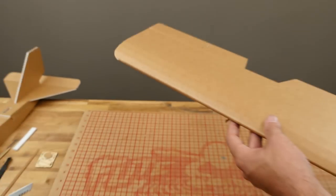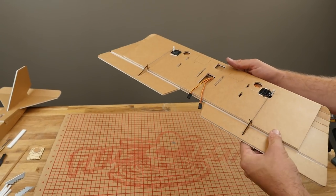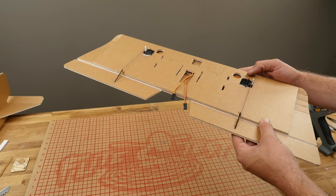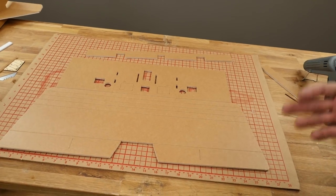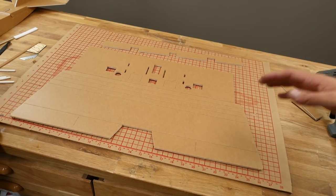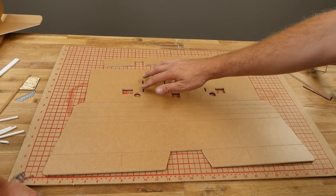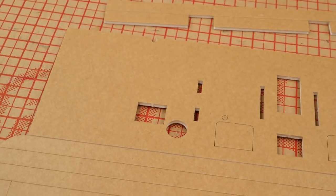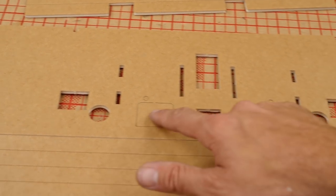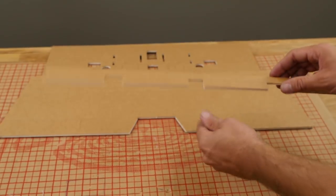In this portion of the build, we're going to be assembling our wing and wing spars, cutting the bevel for our ailerons, installing our servos, and assembling our push rods and control horns. For building the wing, we're only going to really need two pieces, but we're going to have to cut a couple of bevels. Go ahead and remove the holes that you see here, but leave these two plates alone until we get to the end of the build. First thing — let's prepare our spar.